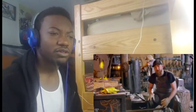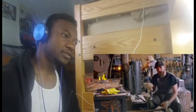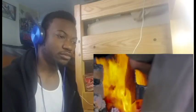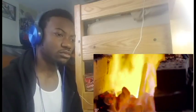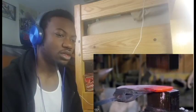So the edge of the axe is now grown too large to fit our welding forge. So what I'm doing is I'm keeping the charcoal forge hot. Ilya's modified our heat treating forge so we can get the axe in there a little bit and gain some temperature. But we really want to achieve our forge welding temperatures here. So we're going to be going back and forth between this forge, the power hammer, and some hand forging, just to spread that edge out to get it right where we want it to be.